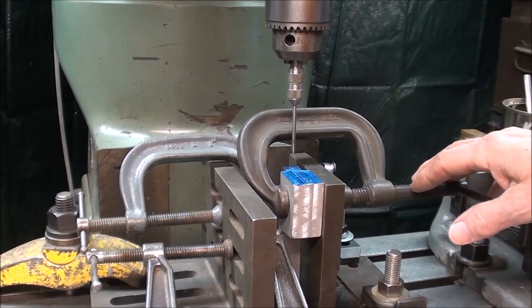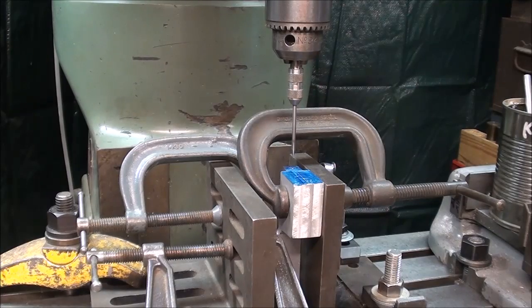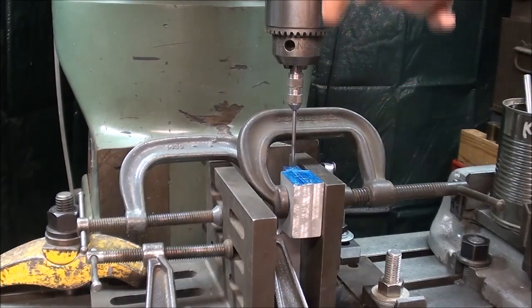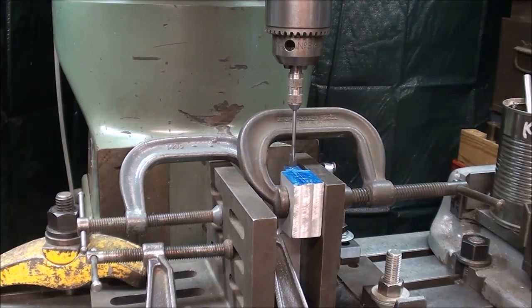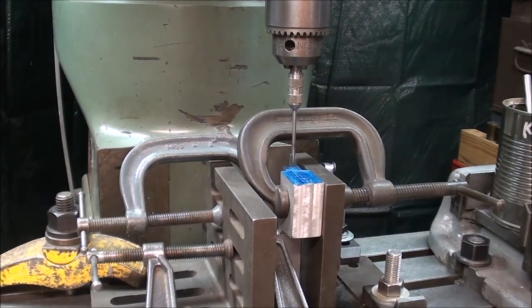The first thing I'm going to do is drill and ream this quarter-inch hole for the valve — the spool valve. Some people call it a piston valve. Both are correct. Now I've lined up the spindle with the center of the layout here using this wiggler — I've shown that in other videos — so now I'll take the wiggler out, put a combination starter drill in there, and give it a go. I've also zeroed out the digital readout now, so I can come back to that point should I need to.